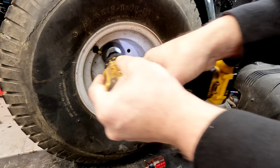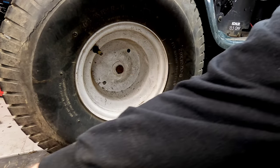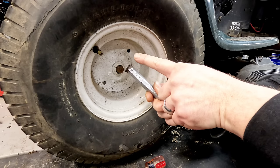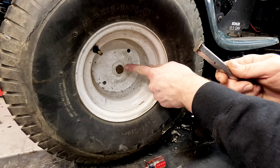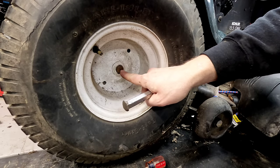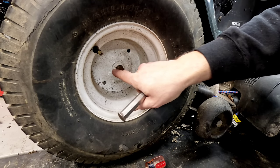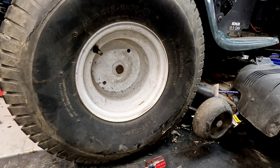Do not try to hit this shaft with a hammer. If you do that, you're going to get some mushrooming to the outside tip — kind of like this. Obviously this has been hit many times. This will make it too wide at the outside edge for that rim to come off. If you've already done that and widened it out a lot, you will have to grind that down and sand it so it's smaller than the inside diameter of the shaft.